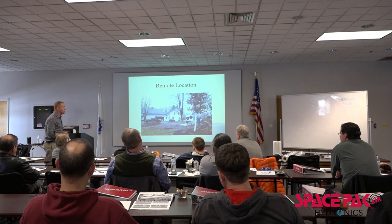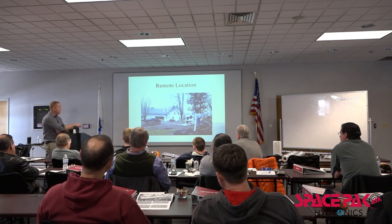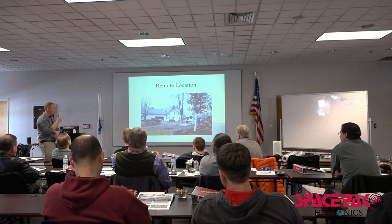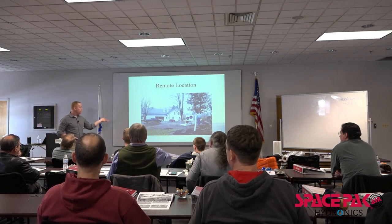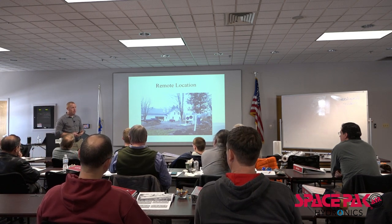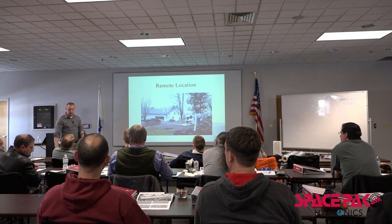Remote location. So remember the conversation before about my education? This is still that same job. So we installed these two units way away. It's actually like 150 feet from that house. Insulated lines underground, pumps on the inside, came out to the outside units and went back in. So you're limited really only by your pumping abilities. You could have this unit, a heat pump or a chiller unit, set next to the house, or you could have it set away from the house.